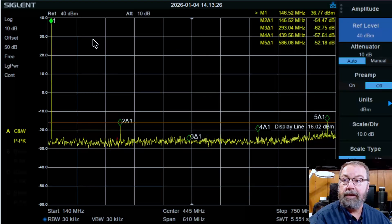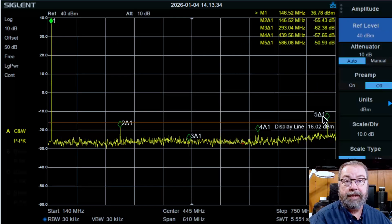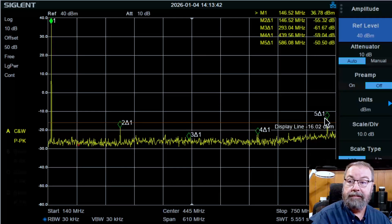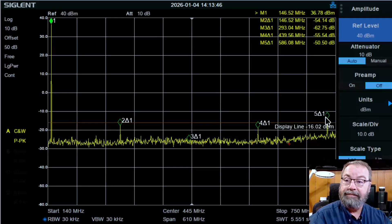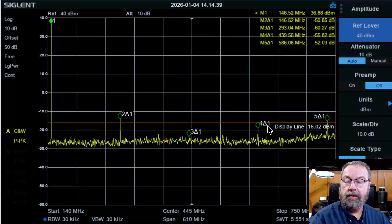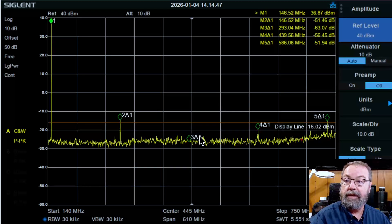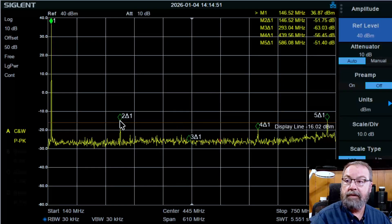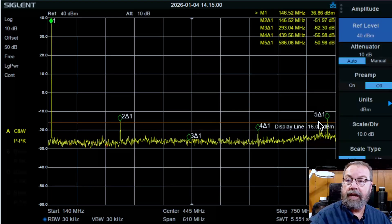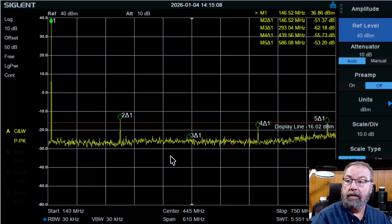There are two criteria: it has to be 43 dB below the fundamental — which they are, since these numbers are relative to the fundamental — but it also must be no more than negative 16.02 dBm, or 25 microwatts. Let's go back and look at the first radio one more time. The reason I went back is I thought this was above the line, and it is. So between this sample of two — which came in a two-pack for about $35 — there's a little bit of inconsistency, because on both, the second harmonic and the fifth are over the minus 16.02 line. With the right numbers in, you can tell they're both indeed a fail.